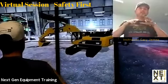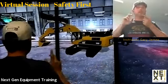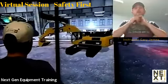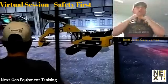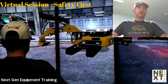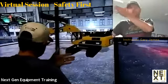Cleaning out my tracks at the end of the day is important for my morning inspection. I clearly can't see my final drives, the pins in the tracks, my rollers, and check all of that if we don't have the tracks emptied out from dirt. If I have completely packed tracks and call it a day right now, I'm a liar if I told you I inspected my full machine — there's no possible way you can see these rollers.